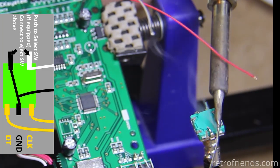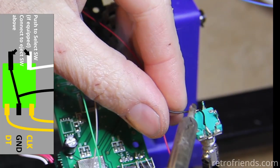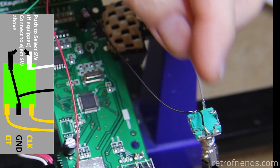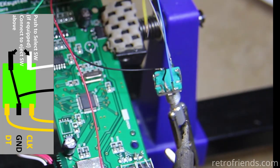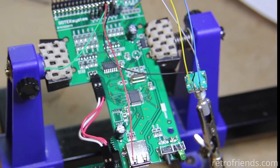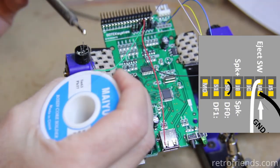Now I am soldering the ground wire to the two pins needed on the rotary encoder, because remember the ground is needed for both the push-to-select and the turning function on the encoder. Then we just need the push-to-select wire, and finally the data and clock. The last solder connection is the piezo speaker — remember, on this type of speaker polarity matters. The speaker is clearly marked.